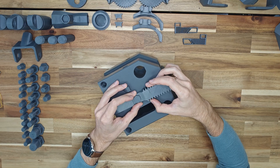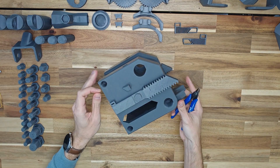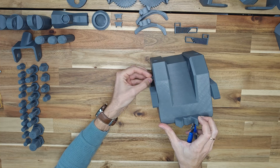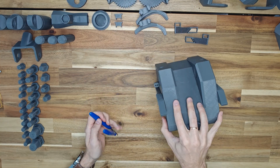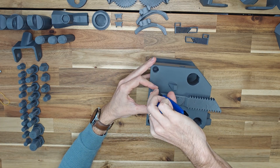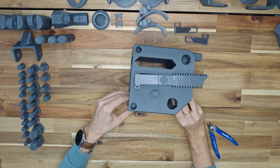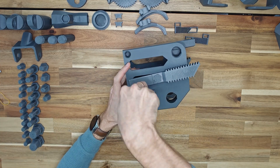Screw the second rail to the trigger with a B2 bolt. If you do not want to use a steel spring, you can skip the next step. If you want to use a steel spring, you will need four screws M4 by 20 mm or 16 mm, four nuts M4, and two springs. The link to the spring will be in the description of the video. Insert the nuts M4 into the grooves and screw the springs to them.